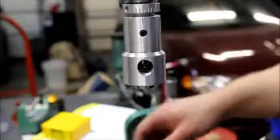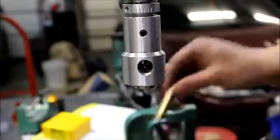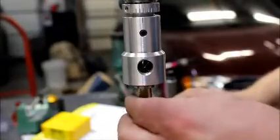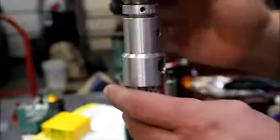Just a quick little video to show how these dead-on trimmers work. We've already taken a trim case, shoved it in the bottom, loosen the two set screws here and slide the end mill till it touches and tighten those down. That's going to get us really close.